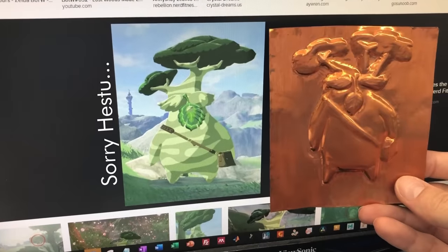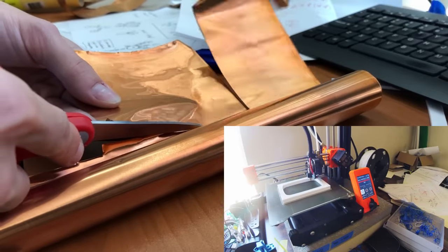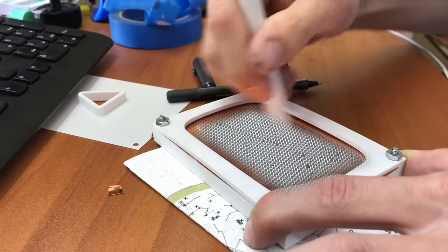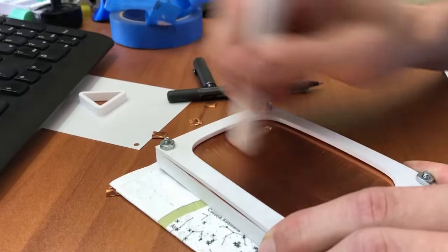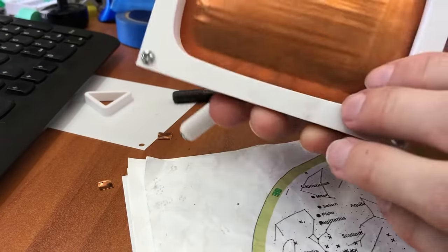So how do we make use of this? Well, I need a new play button, and I want to make it out of an extremely malleable and ductile metal — copper. Because I'm not the best at freehand metal embossing, I cheated. I printed out forms that already had the perimeter of the play button pre-dimensioned, and literally bolted a chunk of foil into that printed frame. Then very slowly, so that I didn't rip through the metal, I used a plastic pencil I had also printed to push the metal out. Every pass of the tool stretched the metal and made it bow just a little bit farther. I was actually able to push this a lot farther than I anticipated — it was over a large enough area that I was able to stretch it really far.